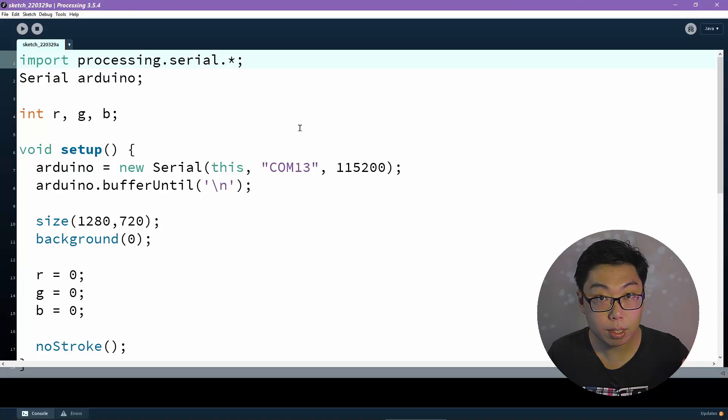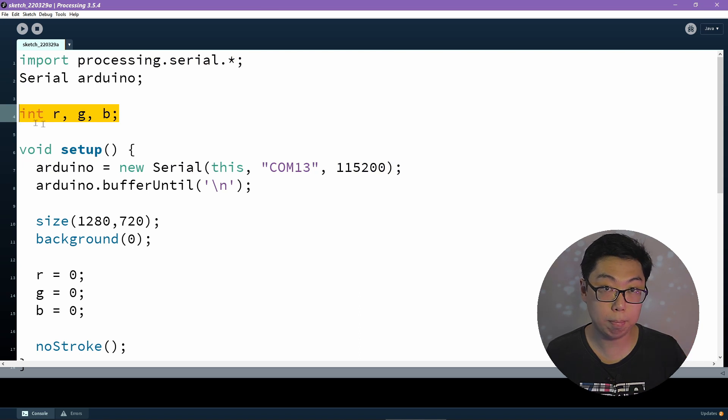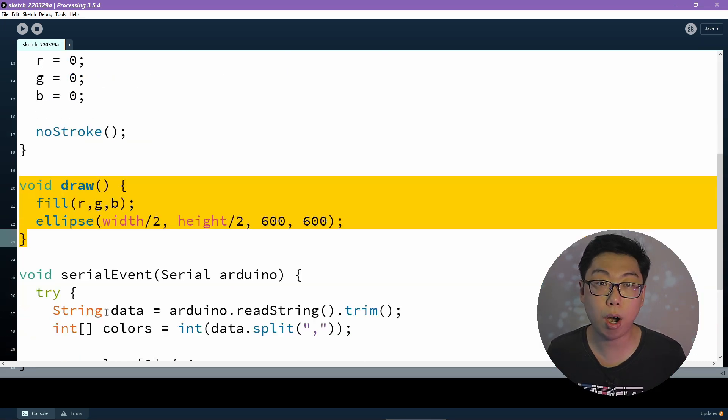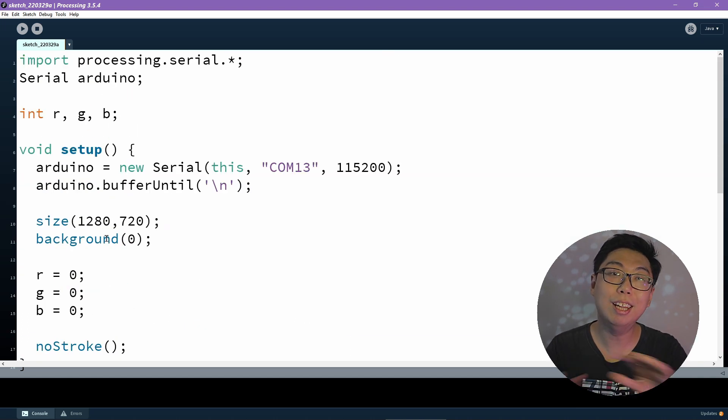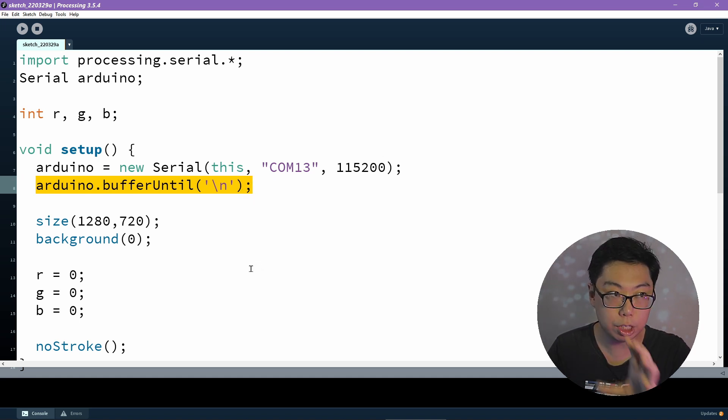The sensor is now basically working, though it's not easy to understand whether it's working well or not. What we really need is some way to visualize the color picked up by the sensor. Enter Processing — we're going with the dream team of Arduino and Processing here. Processing is a Java-based programming language designed for graphics generation, and it's commonly used in conjunction with the Arduino to visualize sensor readings and the like. I import the Processing serial library and open a connection to the Arduino. I create a set of global variables representing red, green and blue. On the GUI side, I set up a canvas and make it repeatedly render a circle colored according to the R, G and B variables. I set up the serial library so it buffers input up until a newline character, which according to my Arduino code happens at the end of each triplet of values.